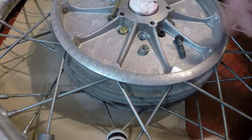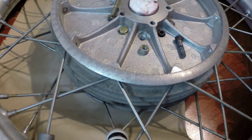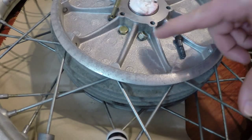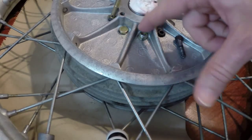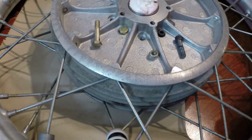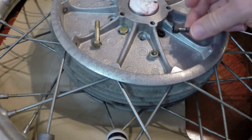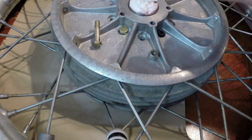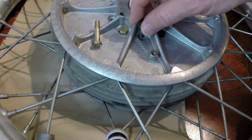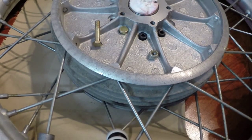There's really no way to make room. You can use a Dremel, but honestly you'd have to remove too much aluminum, and you'd also have to Dremel out a space for a socket to make it even worthwhile. There's just no room on this slash five hub — no clearance for the close-tolerance aircraft bolts. The only bolts you can use are cap head bolts. Cap heads have very small heads, maybe a millimeter of overhang, and they'll fit easily.